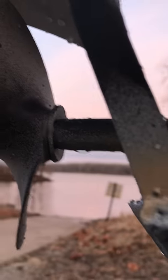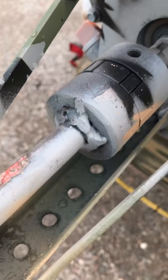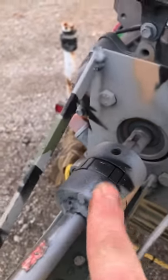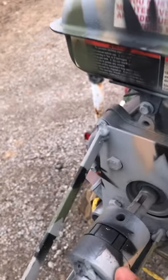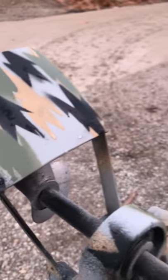I used a 110 flux welder on everything except for the bolt going into the shaft and the shaft going into the Lovejoy coupler. You could probably use the set screw on this, but definitely use Loctite. I'm not sure if the 110 would have worked on that part or not.